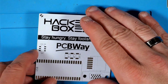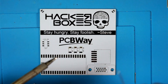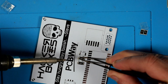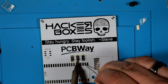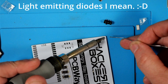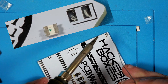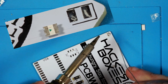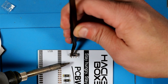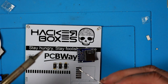Let's get this board flipped over and start soldering. All of our components will be on this side of the board, but we'll have one bit of soldering on the other side. I'm preloading one side of all the resistor pads — a 68 ohm goes in positions one and two, and a 100 ohm goes in position three. The optional tiny LEDs go on the corners — note the orientation, with the arrow pointing toward the corner but face down, so they shine back toward you, not through the PCB. Then the switch goes on.